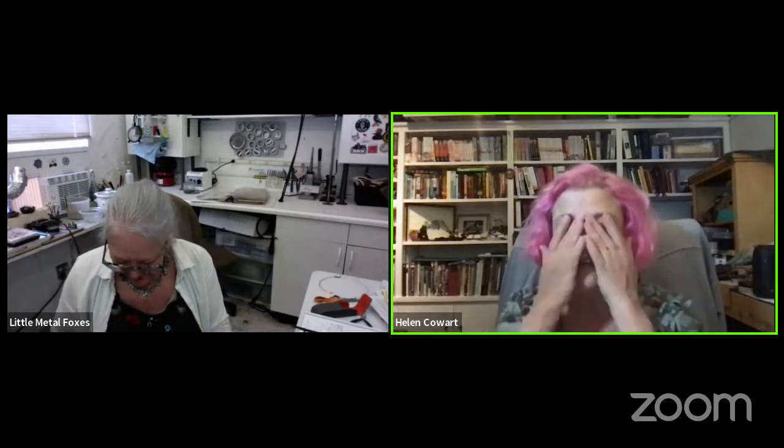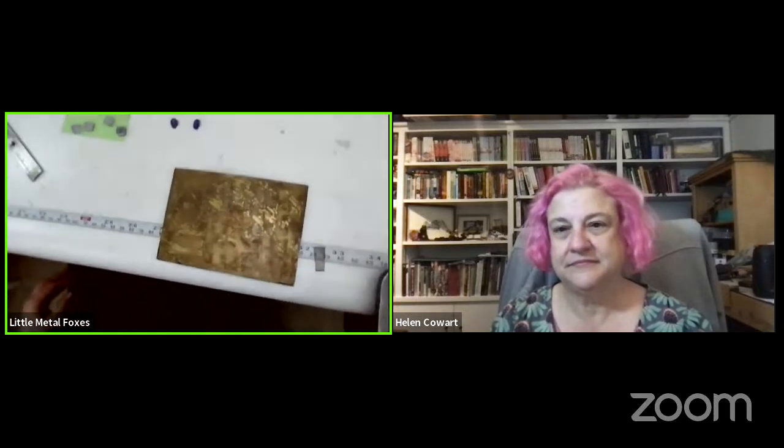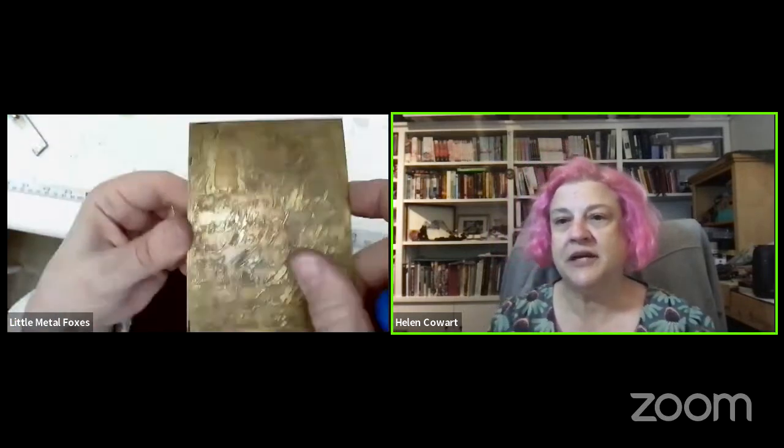Another thing I love to do with bronze wool is stick it on a split mandrel — you can do that with a lot of different materials, like even thin magic eraser strips. Let me switch my camera over so you guys can see a little demo. I've got some inlay — actually, it's etched — a piece that's great for demonstrating this because I don't want to remove any of the texture, I just want a satin finish to show it off.